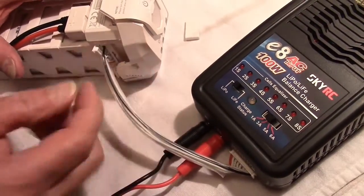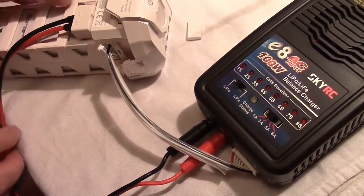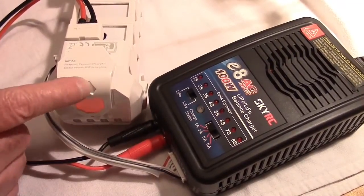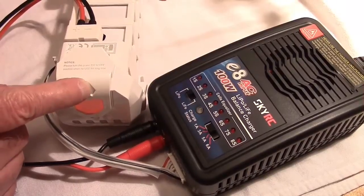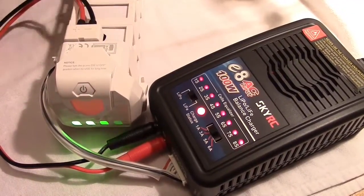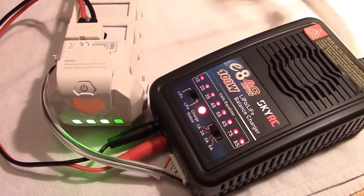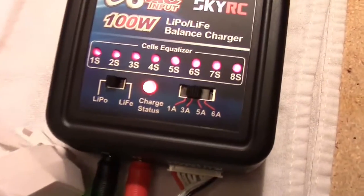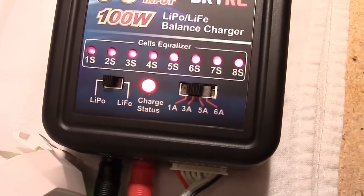Now this next part is not in the manual, so you might want to pay close attention. You have to turn on the battery and then hold the button for several seconds until the green lights come on. At this point, the lights will come on solid for the cells and the charge status light will be on solid red. The battery is now charging at this point and it may take 45 minutes or more for